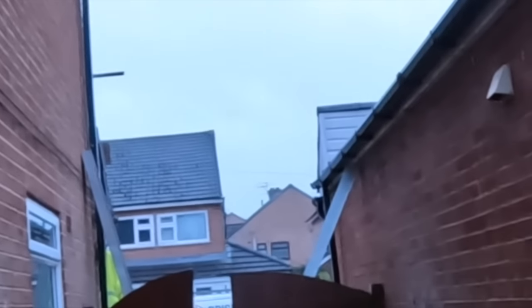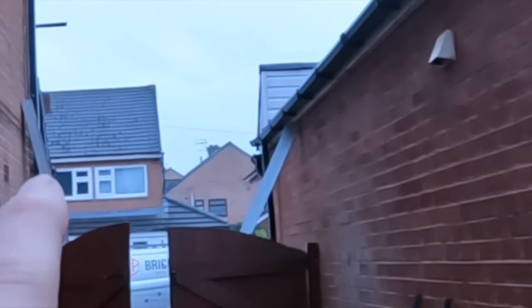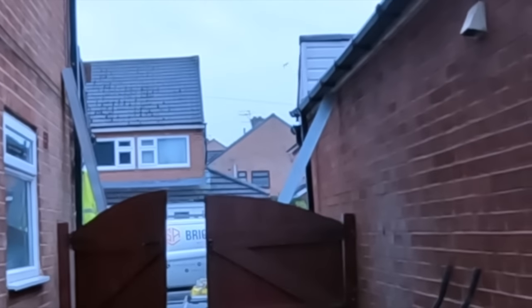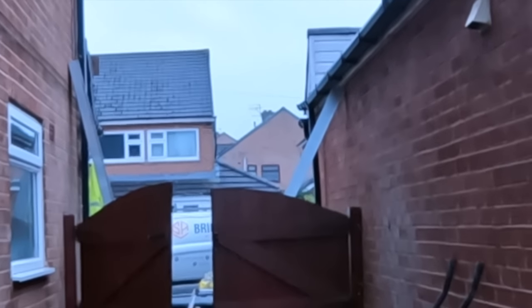So we've got the two 3 meter lintels there. I hope you can hear me over that stupid mixer. We've got this one to cut in half for our next job, because it didn't have any 1500s. And we've got this one to cut down for this job. It's got a massive upstand, but we're not putting a tray in this, so it doesn't matter about the upstand. It's probably better for the big span anyway.